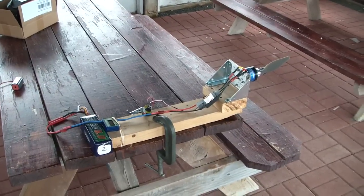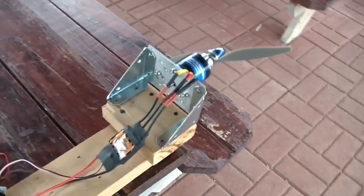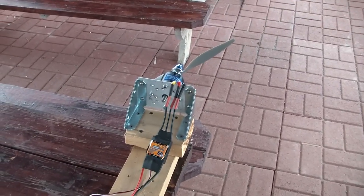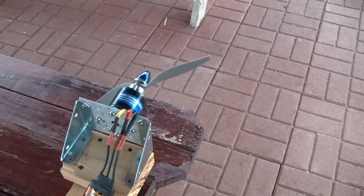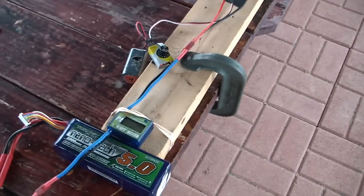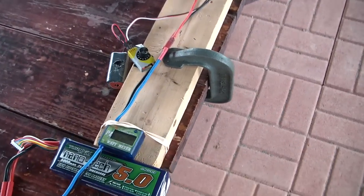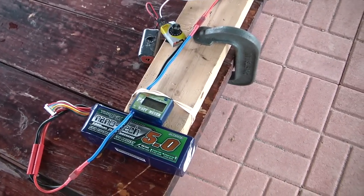The next thing I'm going to do is run a wattage test. I have a 60-size 400kv motor with about a 13-inch prop, a speed controller, a servo tester, and a watt meter. I'm going to compare the wattage draw of each pack under full throttle using the same electrical setup — same speed controller, prop, and motor. To even things out I've pre-discharged each pack down to four volts per cell, so the resting voltage will be around 24 volts. That puts us in the flatter part of the discharge curve.